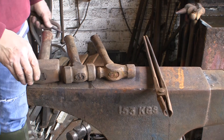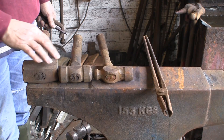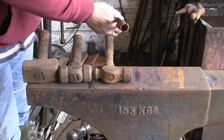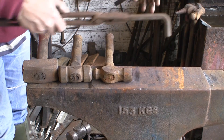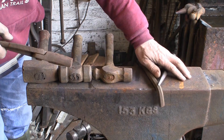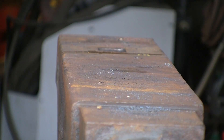I'm going to use probably three hammers: a heavy one, medium weight, and a relatively lightweight — they're four pound, two and a half pound, and a pound and a half. And obviously you need a good set of V-bit tongs, something that will hold it good and tight so it's not going to flap about. That always makes so much difference if you've got a decent pair of tongs. Right, let's get set up and get going.